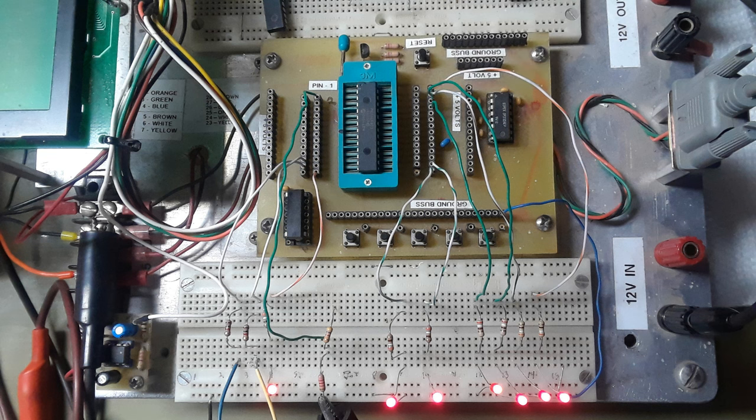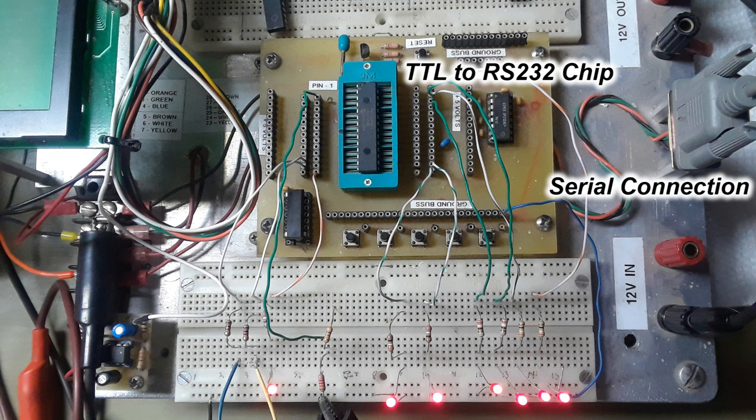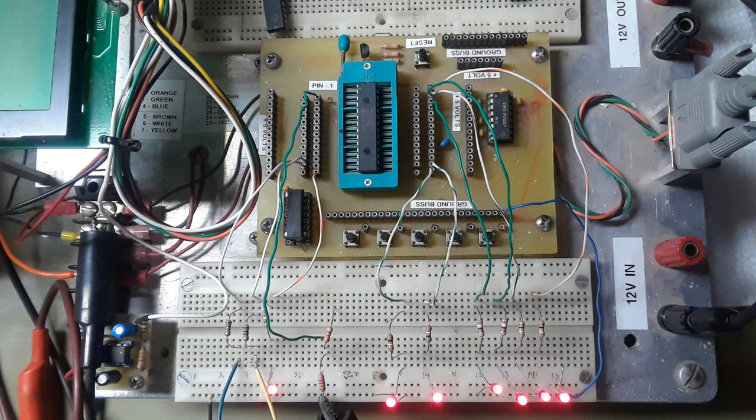As you can see there, the LEDs. The IC looking device on the lower left hand is the clock oscillator module. This is what supplies the PIC with its clock frequency for processing. You can plug in anything you want there. I quite often use just a 4 or 20 meg oscillator module. Later on, I'll use a crystal on the actual circuit board. The other IC on the upper right hand side is the TTL RS232. This converts the serial data coming from the computer, which is the editor for writing the code. It's RS232 and has to be converted down to TTL for the PIC itself. So it does that job. It doesn't get onto the main board later on. Sometimes it does, sometimes you need it for a computer hookup, but in this case we won't be using that. Just for the evaluation board only.